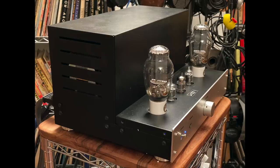I told you earlier I was going to use the 300B amp, the Elekit TU-8600R, with the 40th Anniversary speaker, and I did. And you know what? It was kind of a disappointment. I have to admit, on paper, it wasn't an ideal match, in that it definitely felt underpowered. It was 9 watts per channel. It's about a 90 dB sensitivity speaker, so it was borderline acceptable, but it definitely felt like it didn't have enough juice to make it go. It sounded okay with acoustic music played at moderate levels, but nothing even there. It just wasn't intriguing enough to make it recommendable on any serious level. So that amp went in and out pretty darn quick.